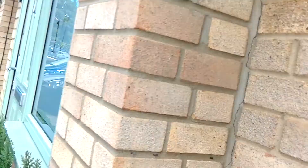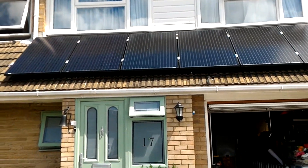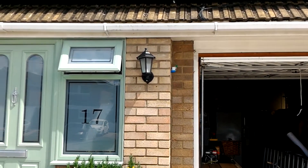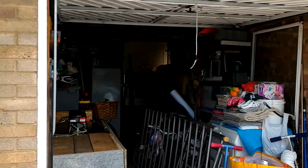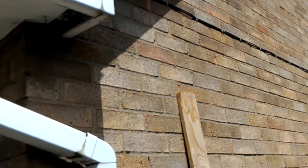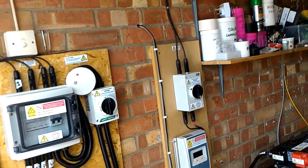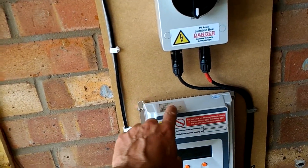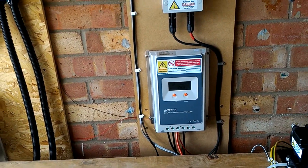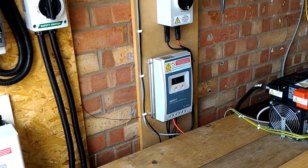The front lot are all wired — all six 250-watt panels. They're all wired in parallel, though I think there are two actually in series, so we don't go over the 150-volt max of the 60-amp controller. And the four on the back of the house — the cable comes down the side of the house and into the garage. There are two wired in series and then two in parallel, so the voltage is around 75 volts and a max of about 16 amps. We wired two in series and then went into parallel — the higher the voltage with a long cable run, the better.